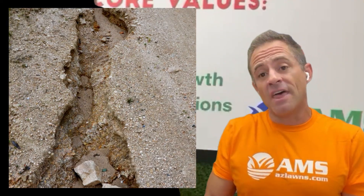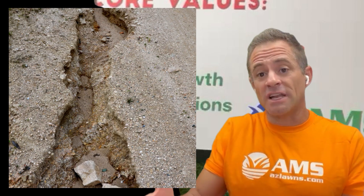Just to reiterate, we love using larger stone — riprap, river rock type stones, like your three- to eight-inch stone — for slopes, stream banks, or any areas that hold water. If you have retention areas where water sits, the water just destroys everything at the bottom. If you have larger stone there, there's really nothing to destroy. Even small rocks will eventually dissipate into the dirt and just look like dirt after a while, and nothing's going to grow there because the water will sit too long and prevent anything from living there healthily.